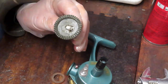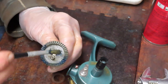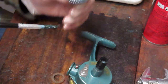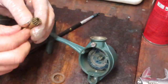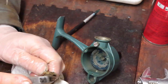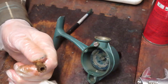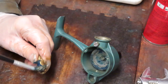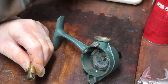We're going to go ahead and re-grease the teeth on this. You don't have to get grease in every tooth, but get enough of it, and you do need to get it on the inside here — that's where the crosswind block is going to ride. This can go back in. Now we can do the same thing here. If you notice any debris, go ahead and take a brush and clean the channels. We'll get that stuff out, wipe off any excess, and go ahead and reinstall. Get some on the shaft where it's going to ride through that bushing, and get some on the teeth that are going to intersect.